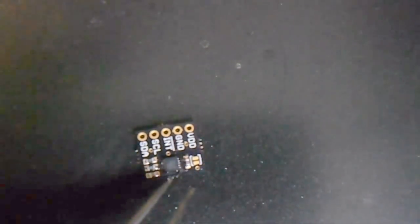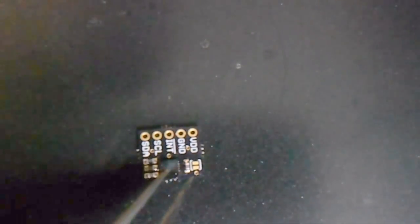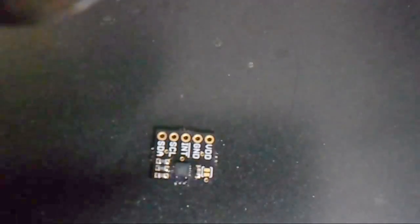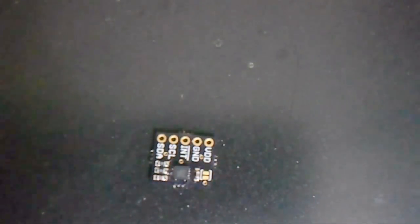Just to make sure everything is lined up, tap on the IC and it should move slightly but fall back into place. Okay, remove heat. Once heat is removed, just let it cool there for about 10 minutes and that's it — you're done. You could go ahead and do the through-hole parts, which is this five-pin header right here.